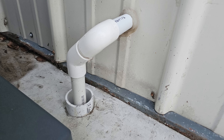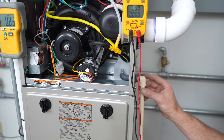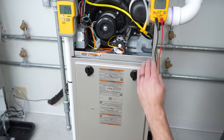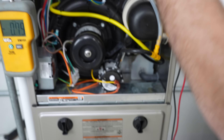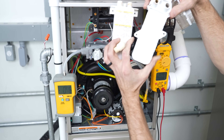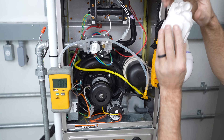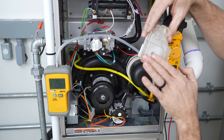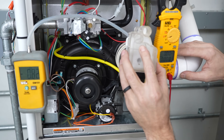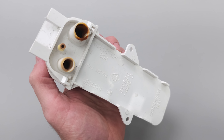If this line is going directly outside, it could be freezing. There could be some type of clog in the line itself or inside the trap — it could look like any one of these examples here. You could have biological growth on the inside of the trap, or even shavings from the initial PVC installation clogging the inside of the trap.